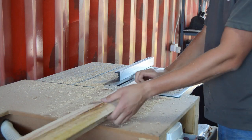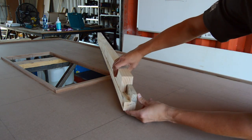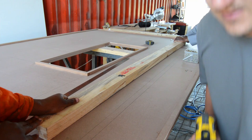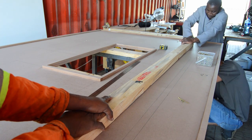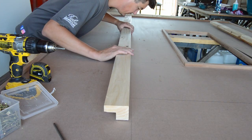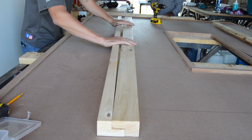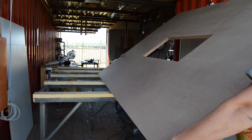Here's basically how the French cleat system works: I fasten one pine beam at the back of the TV unit and the other pine beam against the wall, then the TV unit simply slides in onto the pine beams. This is one of the reasons why I marked everything out previously — to make sure the pine beams are fastened in the right position. This bracket gets fastened against the wall and the TV unit just slides in. Then I'll turn the unit around and start working on the front.